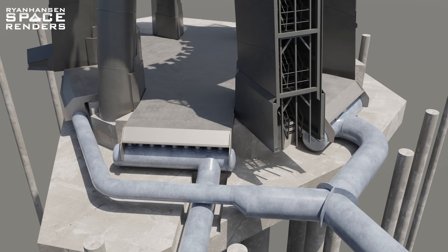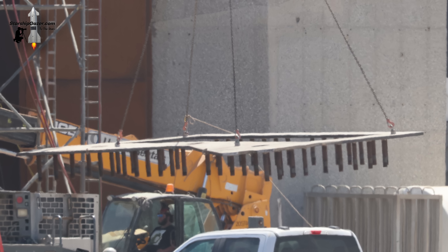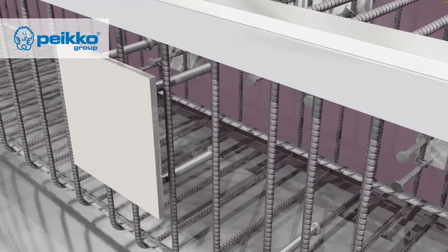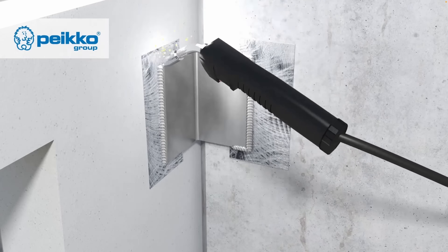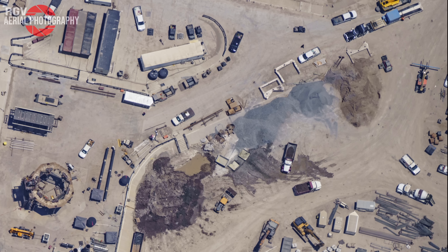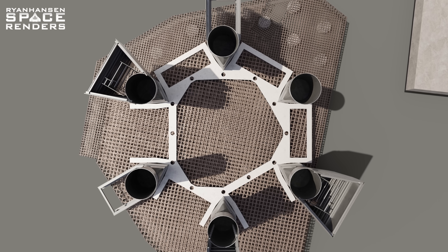In order to mount these massive steel plates, there needs to be a way of anchoring them to the foundation. So while these rebar cages are being laid, several cranes have been busy placing steel embeds on top of the rebar cages. An embed is a steel plate that typically has studs welded to one side — this side is embedded into the rebar cage and will later become part of the concrete structure. They are used as an interface between the concrete and structural steel members. The top side can either be a flat surface for welding or have threaded studs to allow structural members to bolt down. There are square embed plates in various locations in the lower tier, likely for attaching brackets to support the pipe manifolds, and also significantly larger U-shaped embed sections where the water-cooled steel plates will actually rest.